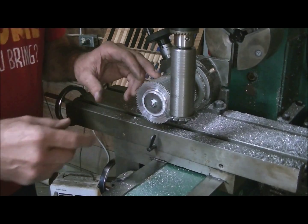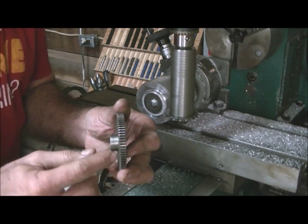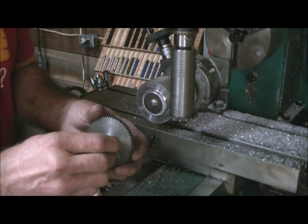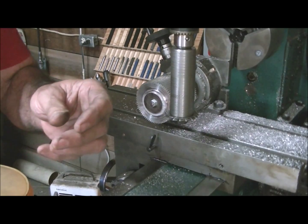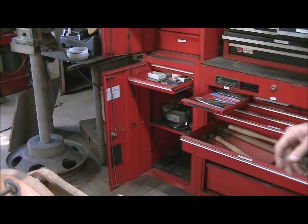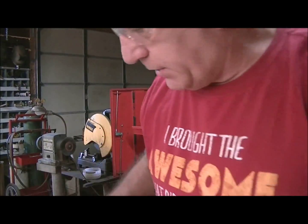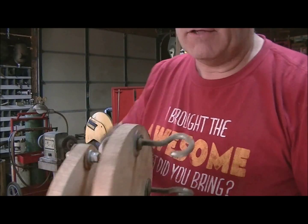I made four of them. I'm going to be able to separate these on the lathe, I hope, and turn them into four gears. This is approximately what I'm making — you'll see there's a shoulder on this gear. This one has a keyway; I won't have a keyway, I'll just drill a hole and put a set screw on it. What I'm doing is just a hand-cranked little machine that I'm building.